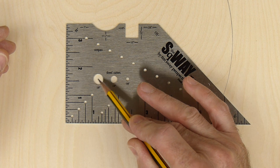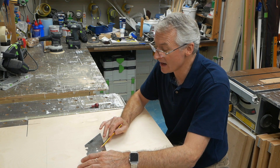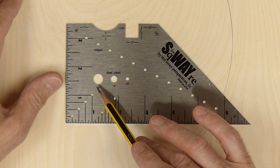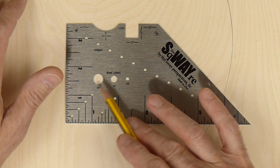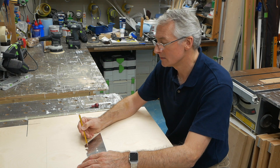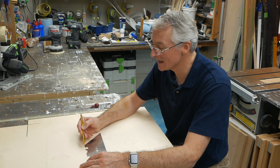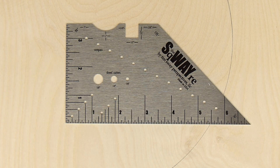The dowels — these are little dowel hole maker things, you can make your own dowels — I think I'm never going to use that. But again, you'd want this, which is 3/8, quarter, and 8th, to probably be 10, 8, and 6 mil, maybe 12 if you want to go bigger, maybe 4 if you're going smaller. And up here you've got a little half inch cutout — well, what? 10 mil or 12, I don't know. 3/4 inch needs to be 18, quarter inch needs to be 6, an inch needs to be 25, and the inch radius scoop out there needs to be 25 mil as well probably.